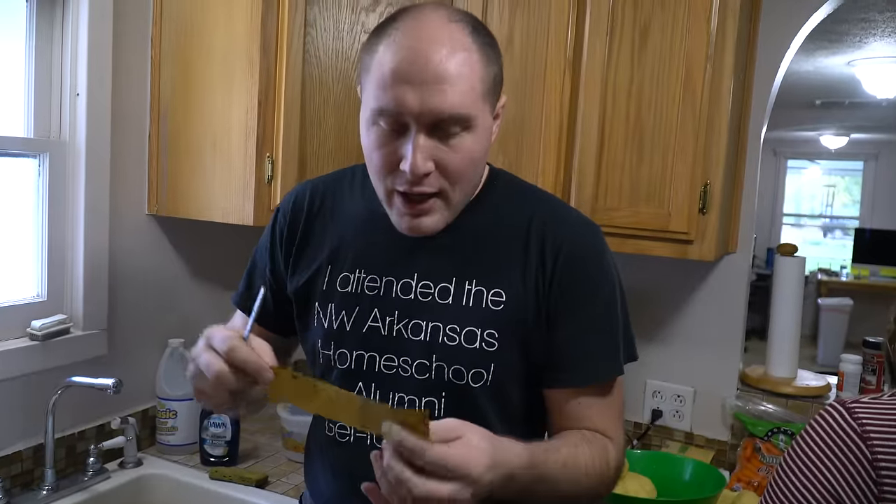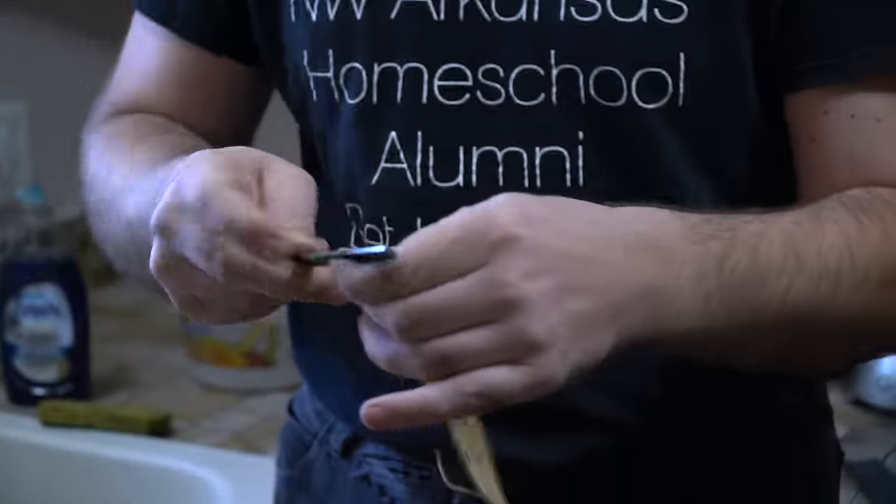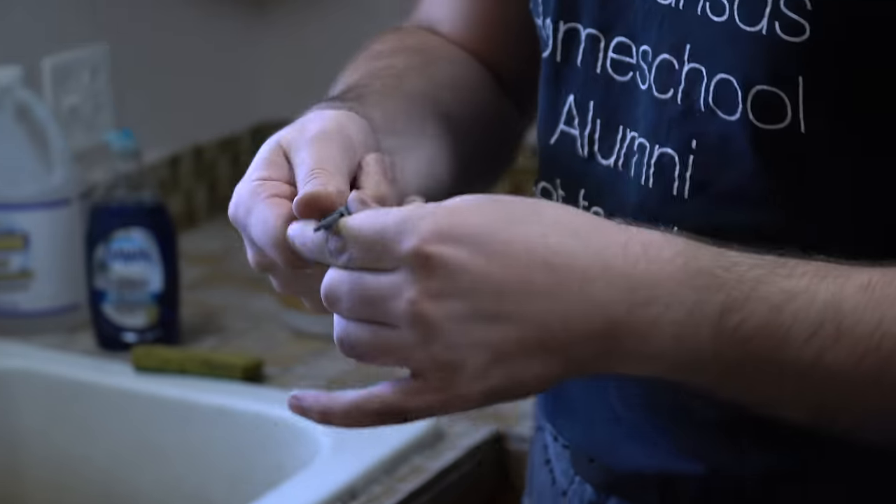It's been another two and a half minutes and we're going to take it out and clean the oxides off again. Because of the bad spot I've got to readjust and go with the flow. At this point we want to switch to 2500 grit sandpaper — no more 1500 grit. I'm guessing the blade is about halfway done being etched, so I like to do the second half with 2500 grit paper.